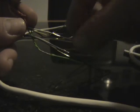It's always better off doing this as good as you possibly can, so it'll last a little bit longer. If you have a soldering iron, it's always better to solder it, but not everybody has them. So most people have to make do with just doing a tape joint or putting it in a connector strip. But obviously if you put it underneath your carpet, you're not going to be able to fit a connector strip underneath your carpet. So what I'm going to do is do half of these with a connector strip and half of them with just plain insulation tape.